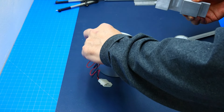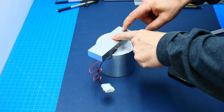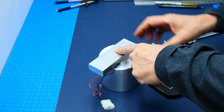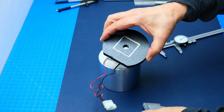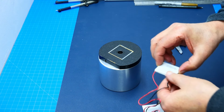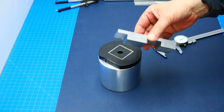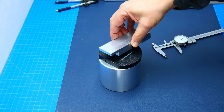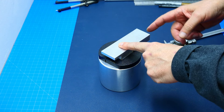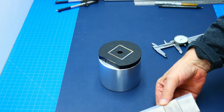How this works: one piece goes in here, the other goes on top, we put a bolt through both into the cup holder. Next we machine this part out so the heat sink and mount work as one piece. Then up here we're going to make a panel for switches, LEDs, or whatever — that's the plan. So I'm going ahead to the mill to machine this part out.